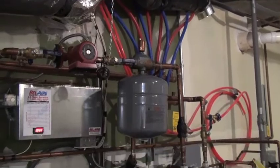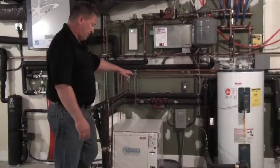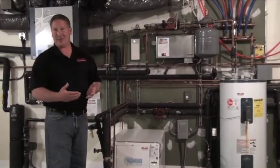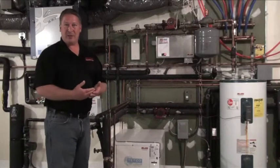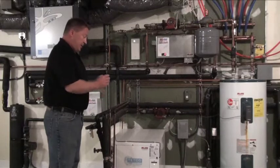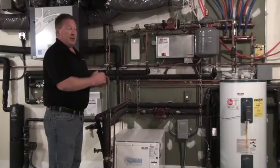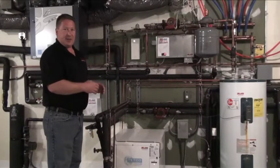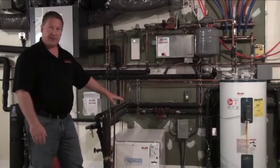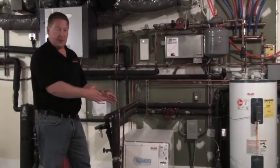The geothermal itself uses a compressor to do the work — it's a refrigerant compressor. It uses a refrigerant called R410A, which is an environmentally friendly refrigerant, meaning if it's released in the atmosphere it won't deplete the ozone layer. Maintenance-wise, it comes factory pre-charged and shipped pre-charged, so there's really nothing installers or service technicians need to do with the compressor unless there's a failure. We don't even like to hook our gauges to it when first installing, because that's already been done at the factory.